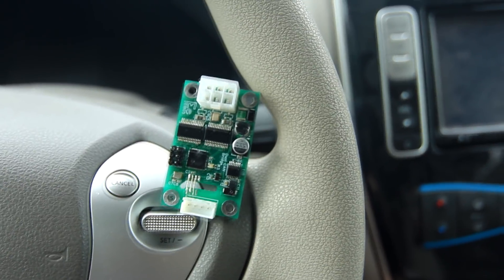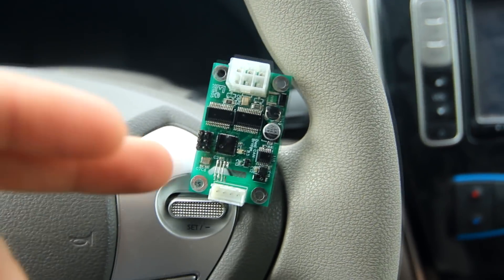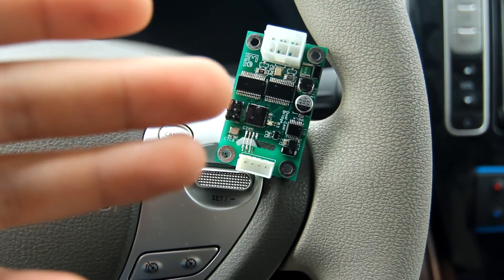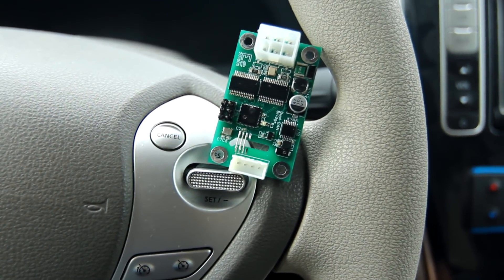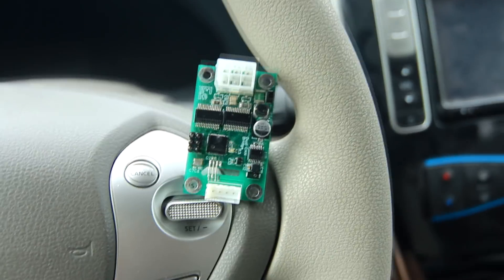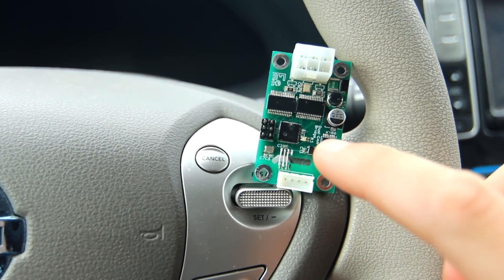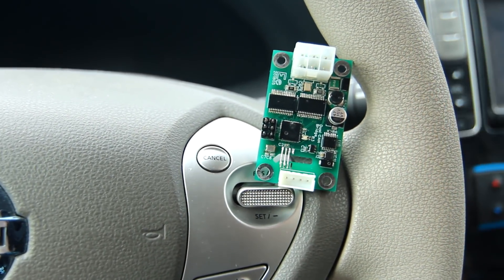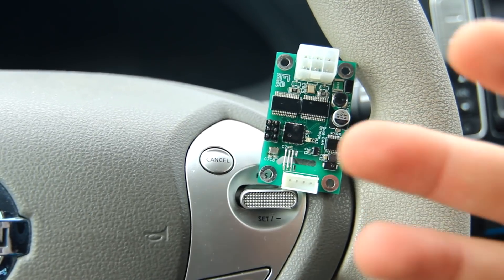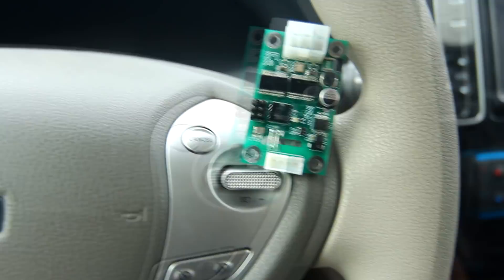There are still some issues with these boards and I'm going to revise them probably this week. There is a serial port with an isolation slot — the plan was to pot this entire thing like most automotive electronics, completely seal it off from moisture ingress, and make sure it can dissipate heat relatively easily. The problem is the isolation chip I chose — one of those standard capacitive isolation chips — apparently wasn't that standard. It went out of stock pretty much everywhere as soon as I wanted to assemble these boards, so I have to replace them with ISO 7221s, which are extremely easy to get.